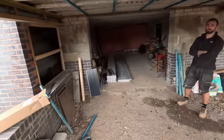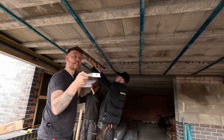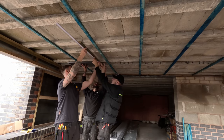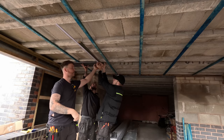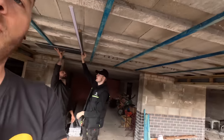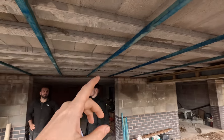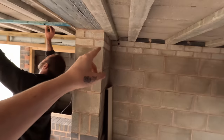So the plan is I'm going to set you up on the tripod. We're roughly marking it out - let's do exactly what we did before. It's going to go in here, but obviously with the profile we need to make sure it's sitting perfectly. We've never done this before so we're all new to this. The soffit board is going in, it'll be nice and neat - when the ceiling's finished it should blend in beautifully. All we need to do is make sure it's square - that's the biggest thing. We're going to run our 12-volt cable, we've got a bit on the floor, and because all this is getting boxed in behind me, if there's ever a problem with the drivers we need to make sure it's accessible.